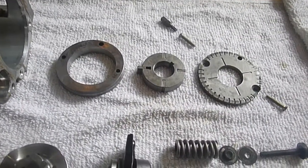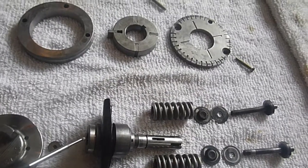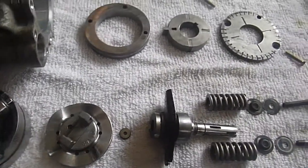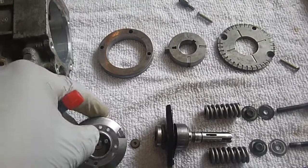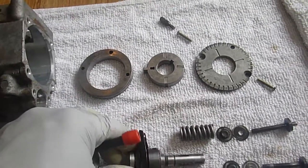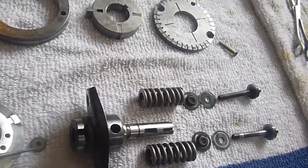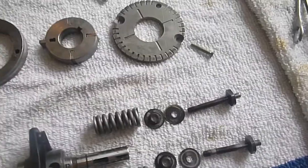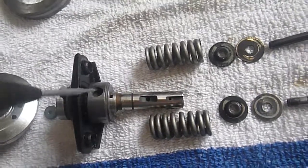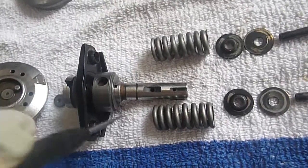There's the all-important shim that goes between the spring and the plunger body. That shim protects it from the reciprocating plunger. This reciprocating plunger has a key on it — that key actually corresponds to a key right here, so that goes in between the two. And this is your quantity adjuster sleeve. It should move extremely freely. Underneath it, there is a hole — and there's also a hole 180 degrees on the other side as well.